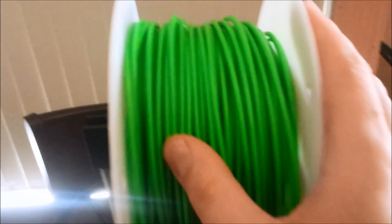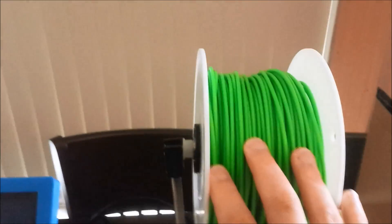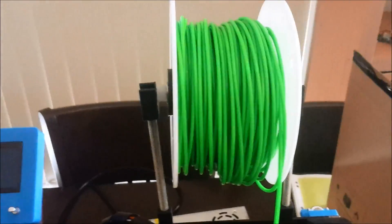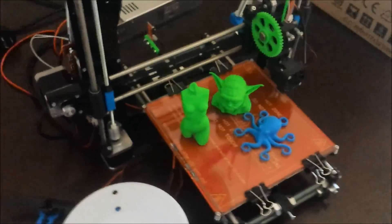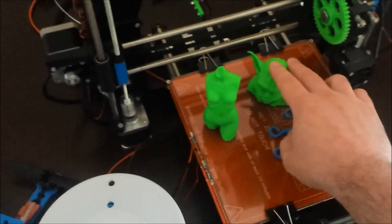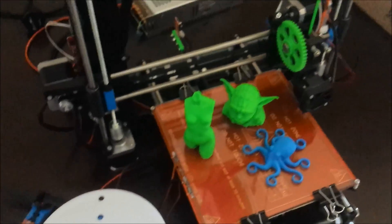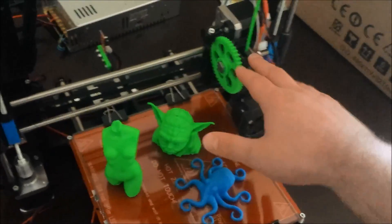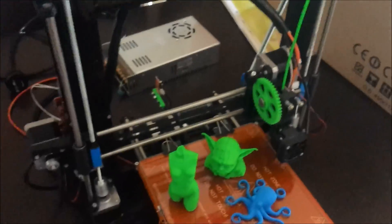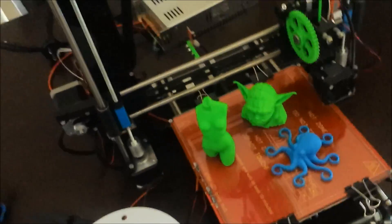The green ABS I have — if I dig a bit deeper I've started to see stress marks there as well, so I'll no doubt experience the same issue. But besides that, still very happy with this printer. I've only been printing in ABS; I'm sure PLA would produce much finer organic shapes. I'm only printing at 0.2mm — that's as low as I've gone. I tried a 0.1mm test cube and it had a very fine finish, but with this particular J-head and ABS it tends to curl up, so I'm still yet to fine-tune the very fine prints. For what I'm using it for — printing quadcopter frames — it is absolutely perfect.